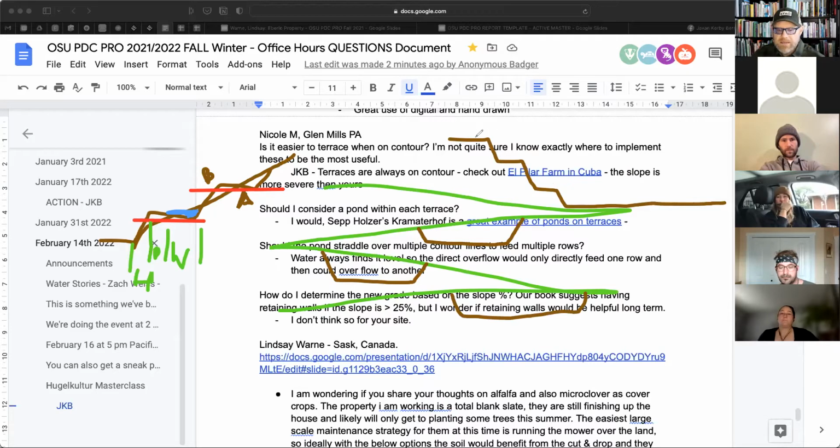So what he does is he'll build out a dock like so, and then he'll put 2 big posts in there. And if you go into my YouTube channel, I have a number of videos when I was out there. Oh my goodness, I imagine it's probably 10 years ago now. And the monk, what ends up happening with the monk here is that the monk is a pipe that comes out and then has an elbow and then has a friction fit. So it's just friction fit. And the reason for that is what you want to be able to do is use this pipe to set water level. So if this pipe was this high, that means the pond would overflow. So what he does is he sets the pond height with the pipe.